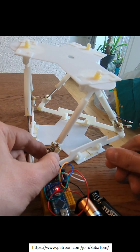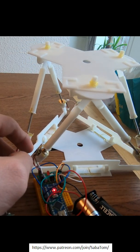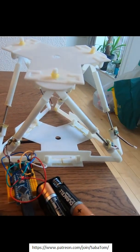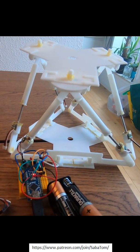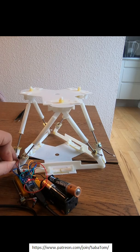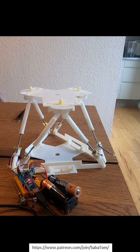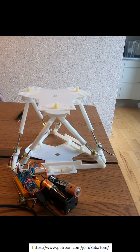I'm thinking of tightening it with some wire instead of glue. I was surprised that I'm able to run it quite fast — stepper motors lose power as motion becomes fast, so at higher RPM you'd expect to lose some position, but that didn't happen.